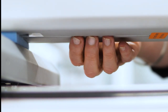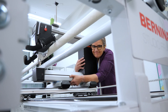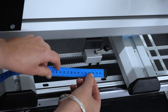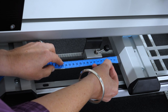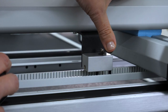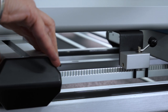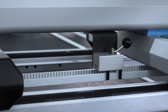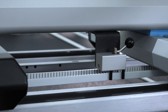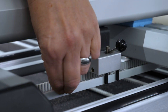The best way to do this is to hug your machine. First attach the coupling only loosely so it can still be moved to a distance of 2 inches measured from the front stand profile. When the coupling is perfectly in place, tighten the nuts, ensuring with the help of one of the removed bracings that the clamp is perfectly aligned parallel to the machine. Open the clamp and pass the drive belt behind the black pins. Move the machine back and forth on the carriage to check the belt position — the teeth should not touch the inner pin, and the belt back should barely touch the outer pins. If necessary, correct the position of the drive motor and idler plate. To close the clamp, turn the lever so it is perfectly vertical and pull lightly on the drive belt to make sure the pin is locked in a recess of the belt.